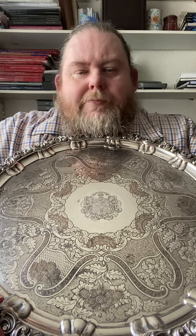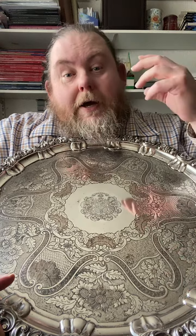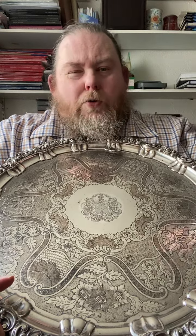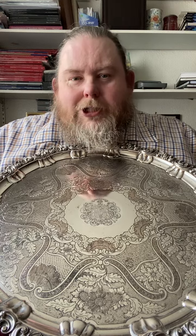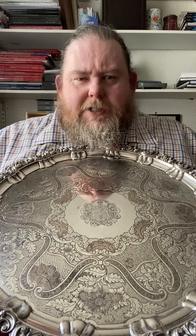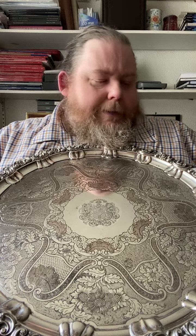That comes in at the very, very end of the 18th century. I've seen some pieces that you could argue were 1795, 1800 in date with these reserves on them. And then they proliferate at the beginning of the 19th century, before about 1840, when electroplate all of a sudden comes in and all the energy and effort made in Sheffield plate starts to become redundant. There's a brief period, about 5 years of changeover, but it becomes redundant.